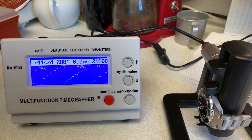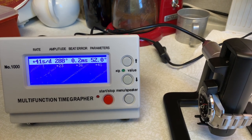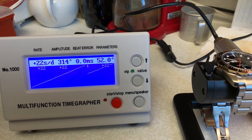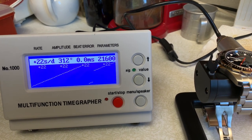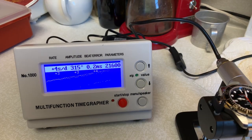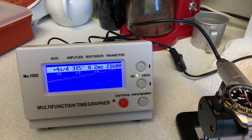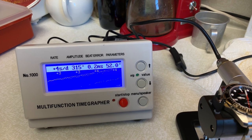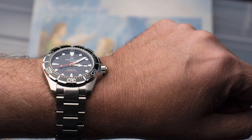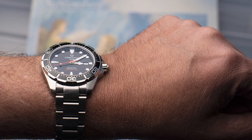I was pretty disappointed when I got this watch as it gained a whopping 48 seconds a day. I thought it might have gotten magnetized, so I broke out the compass. Nope, not magnetized. However, once regulated, the watch is within a second a day. It seems to lose about 4 seconds a night face up on my dresser, but then it gains them back while I'm wearing it during the day.